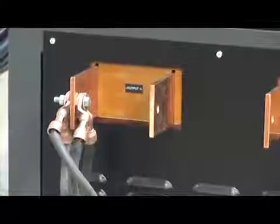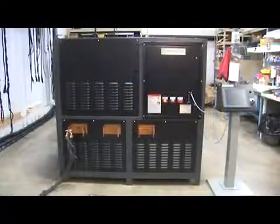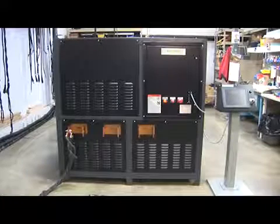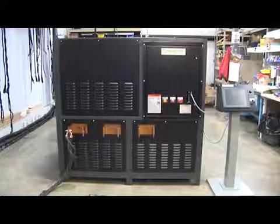Each of the 3 bus bar outputs requires 4 aught cables connected to them. It is recommended to use up to 8 cables per output, 4 cables on each side of the output. This totals 24 cables for the entire unit. Cable length is dependent on the size of the part, but note that the longer the cables, the more the amperage output will drop as well.